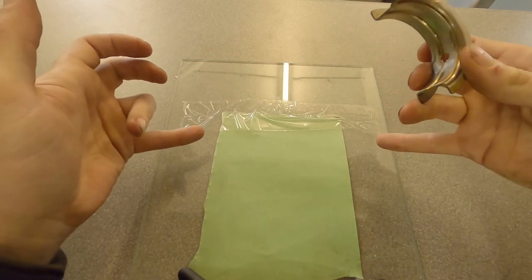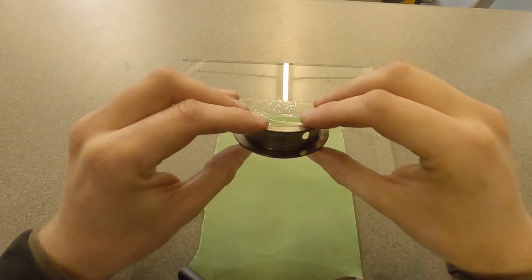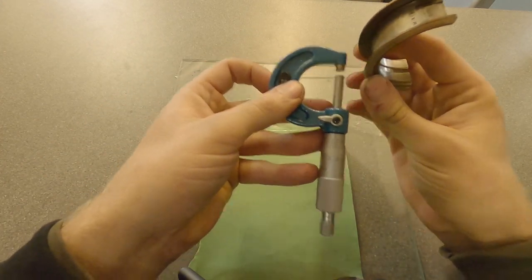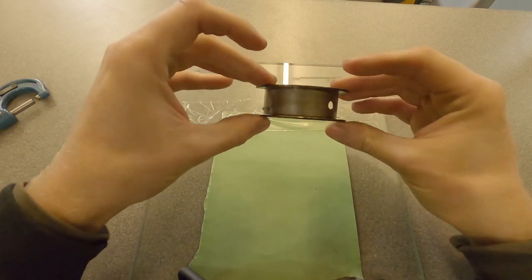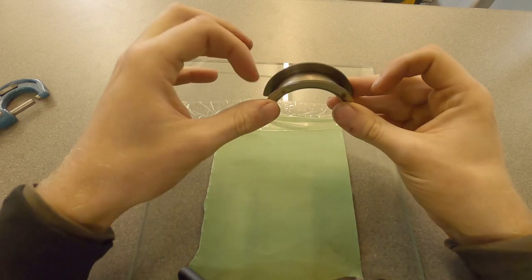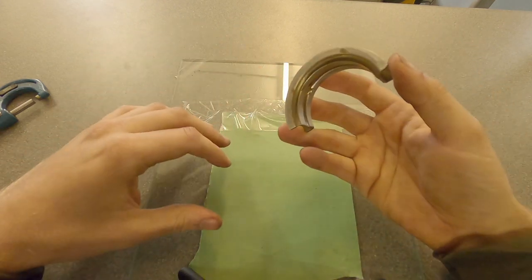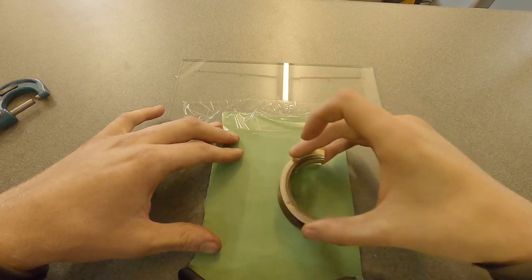What we've got here is a sheet of glass, which guarantees a flat surface. We also have extremely fine grit sandpaper — ideally 1200 grit, maybe 1800 or even 2000 grit, as fine as possible. You don't want a coarse sandpaper. We're going to find the highest spots using our micrometer on the thrust face and try to lower those highest spots down until we've got an even bearing surface. Take the bearing on the glass with the sandpaper secured and gently rub in a figure-eight motion, just gently wearing off some of the material.